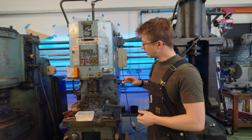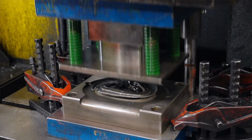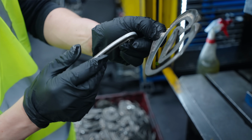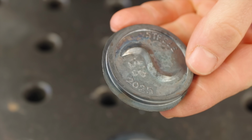In industry, when they do drop forging, the next step is what's called clipping. They go to a press that might not look too dissimilar to that. A punch comes down from above, there's the negative space below, and they clip the flash that gets formed during drop forging. This nasty stuff around the edges. When we made our coins, I had to hand grind this off.